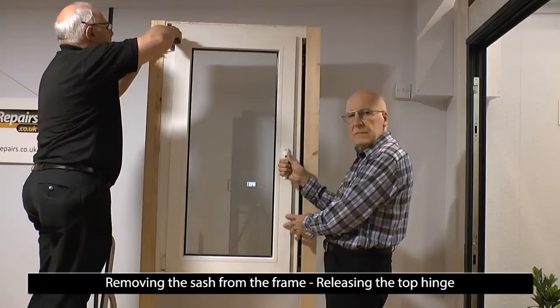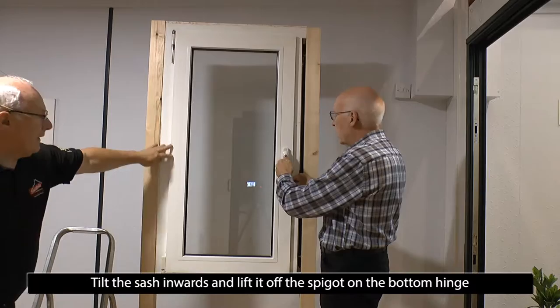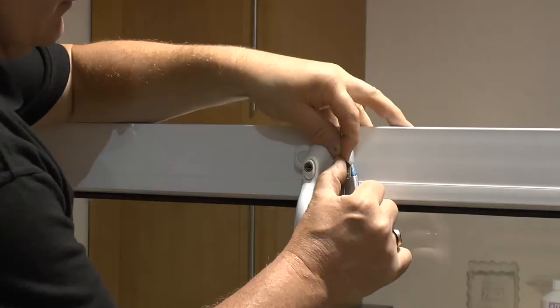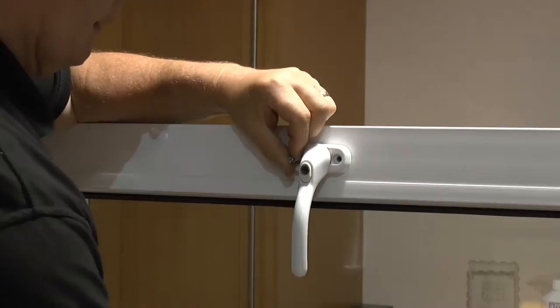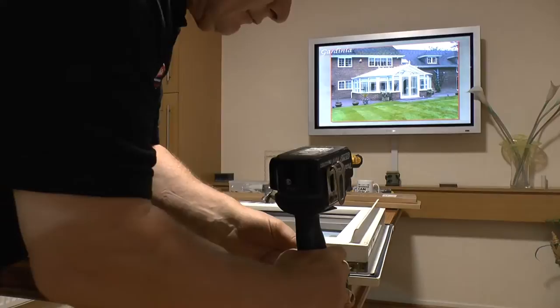Remove the pin — and the bigger the window clearly the heavier it's going to be. So now if you want to just turn the handle and lift it out. The next task is to remove the handle; usually there are some small cover caps over the screws which you remove with a small sharp knife, and then remove the screws completely out of the handle. One, two, and lift the handle out including the spindle — don't leave that in the window if it is loose. And then we start to remove all the screws all the way around the window.